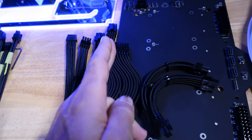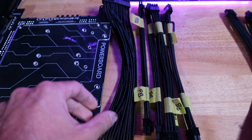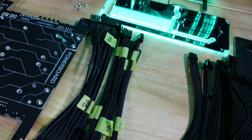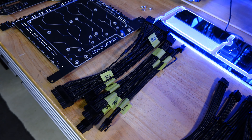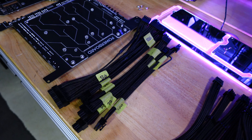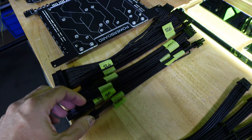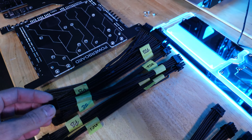Unlike the linking cables, which are one-to-one — meaning every strand goes straight — PSU cables are criss-crossed, have split wires, and it's always different depending on the power supply. When you order one of these, you input your power supply type and we will specifically design the pin out for your PSU. We mark the end that goes into the Powerboard and the end that goes into the PSU. We now make these at 25cm, down from 30cm, since we found we can maintain full compatibility with the shorter length.